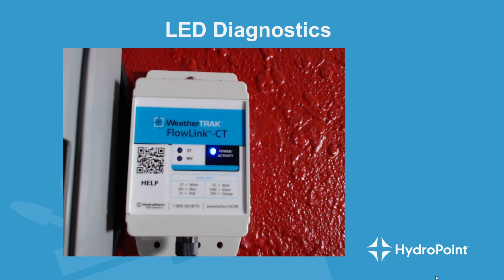For the first 10 seconds, the FlowLink runs a diagnostic and tries to connect the CT to the FXT and the EXT. So you'll see the power and activity LED flicker for the first 10 seconds. After the connection is made, however, that LED should illuminate a solid light, only flickering once every 10 or so seconds to verify the communication.